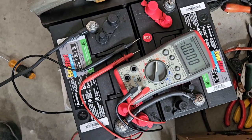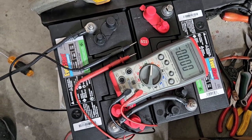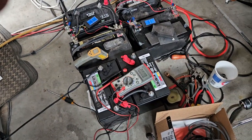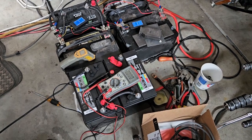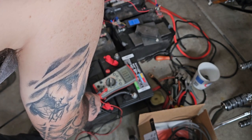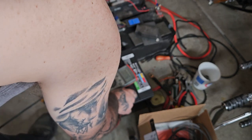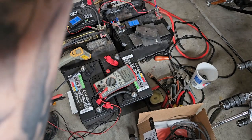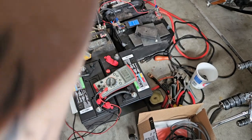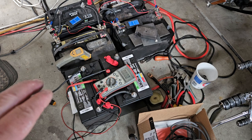I haven't really used them much — kind of had them on float. I've measured the cells and I'll put the camera over here so you can see, but they're exactly the same. This is the bad battery: 13.37 volts. And this one here: 13.37 volts. So they're balanced. The red indicator starting to turn red means the green ball is not floating, so that's measuring specific gravity.